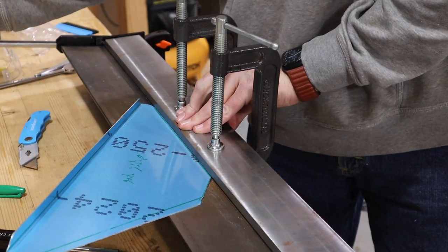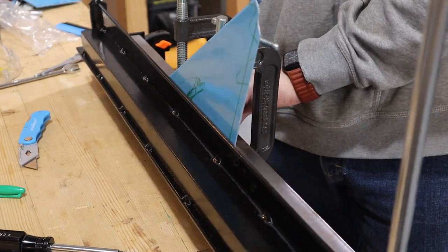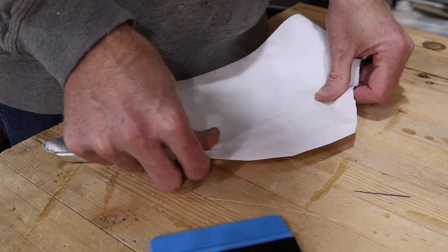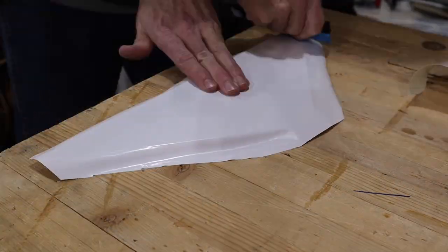Trying to stick to my theme of having as clean of a panel as possible, I decided to put the light switches overhead. We did this by making a panel out of 032 aluminum. I bent up the edges to make for a more finished look and add rigidity. For labeling, we used vinyl.